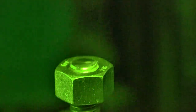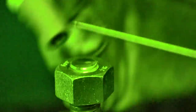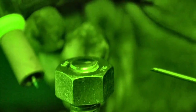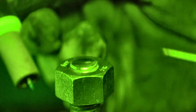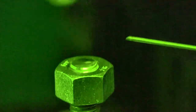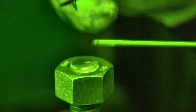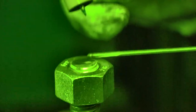All right, I got my helmet on, and now we're set and ready to go. This filler rod I have is just 309L16. It blends good with steel, stainless, and everything in between. Hopefully I can just run a bead around here and take this steel shaft to this grade 8 nut.